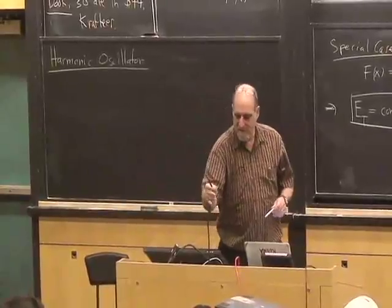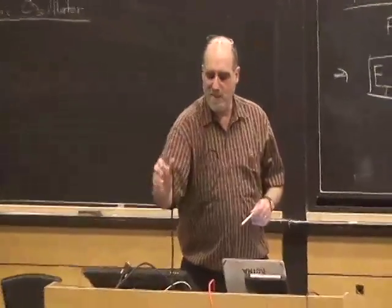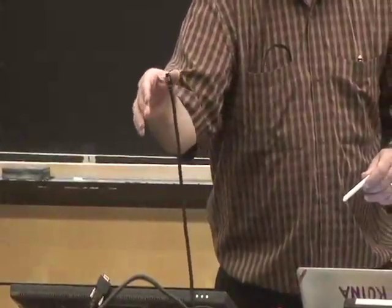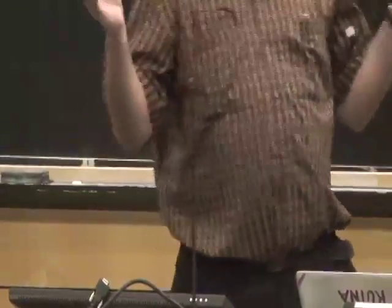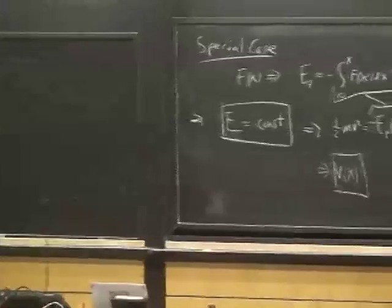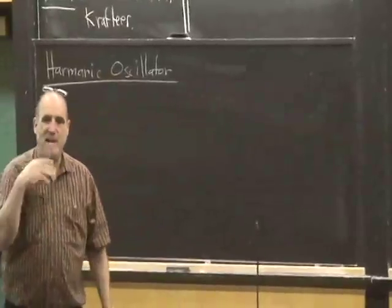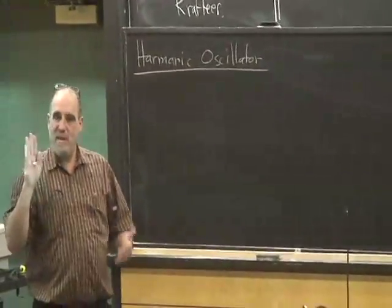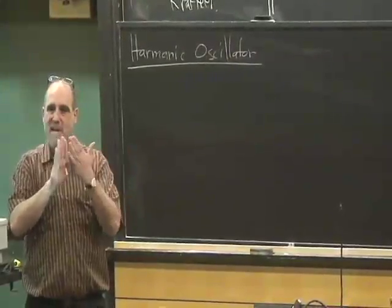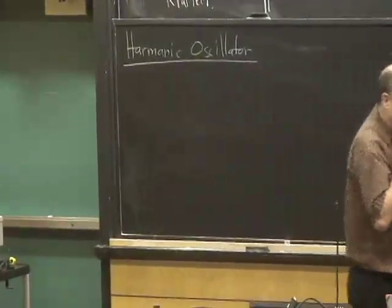That's a pretty good one. So we displace a little bit. We could calculate, if we use beam theory somehow, and do something about the properties of this, what kind of spring this was. It's deflected, I let go, and then it oscillates. And you see oscillations all over the place in all kinds of machines, equipment, not equipment, in the vibrations of a violin string, the pressure of air when it vibrates. In fact, the fact that you hear me at all right now is that the air is compressing and decompressing, and it's an inertial interaction between elasticity and mass, which makes it possible for the sound to transmit, for my vocal cords to vibrate, and so on.